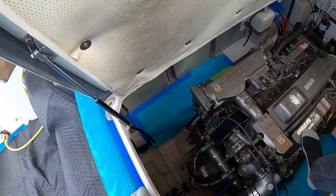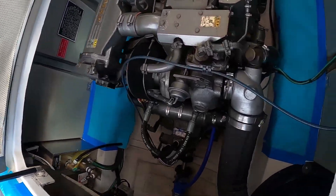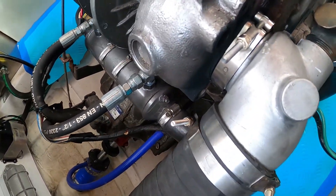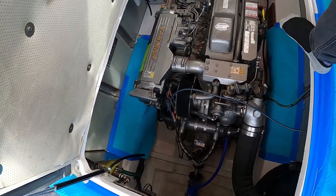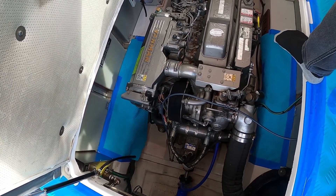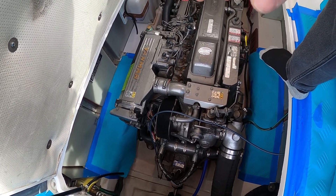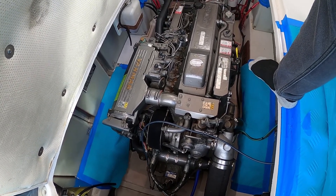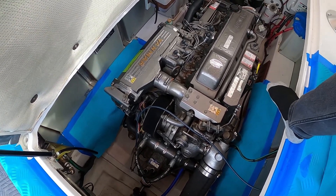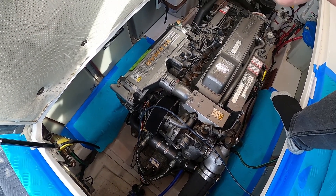We're also going to have to do the turbocharger, because this is what started the whole thing. They hadn't done a cooling system overhaul in so long that the turbocharger - no matter how much sealing paste, no matter what you put on it - it would not seal. So we need to get that turbo to seal. We've got a new turbo for it, but we don't have it today. What I think I'll get done today is taking the charge air cooler off as well as the oil cooler and the heat exchanger.